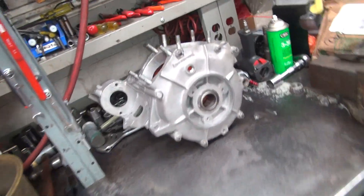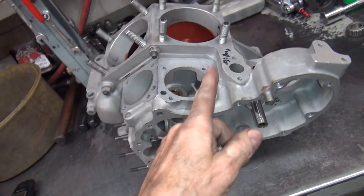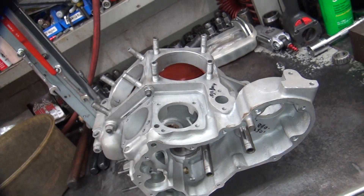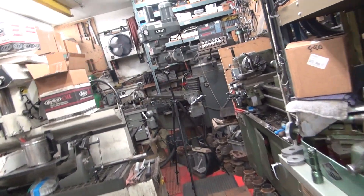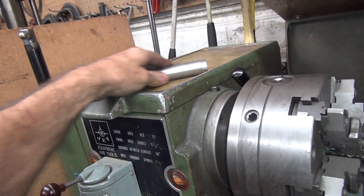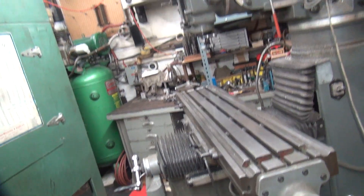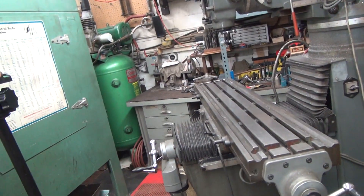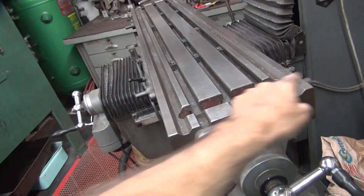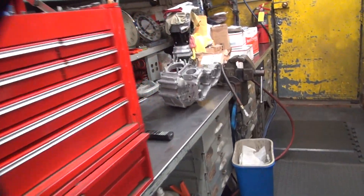It's about four to five hours of work to get the lathe accurate. Now it's accurate — that's what matters. Now I can work on this knucklehead over here — that's what this is all about. I've got to make a bushing, I've got to move this hole over 20 thou, I've got to make a bushing that goes in this hole and I've got to make it accurate. So I want my lathe to be accurate. Last time I used my lathe it was off by 15 thou — pissed me off. So now I'm off two tenths of a thousand — I'm good with that. Tomorrow we're going to work on the knucklehead. I've got the machine all squared up, it's within two tenths of being square. Tomorrow we'll get that case jigged up on there and do some cutting. My tools are working, I'm happy.